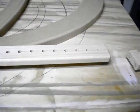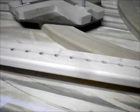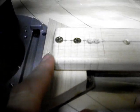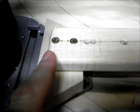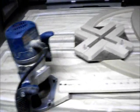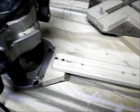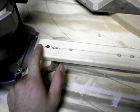Then what you have is this arm here — this is just a piece of three-quarter inch maple with holes drilled every inch. I have quarter-inch spacing over here, so I can move it forward or back a quarter inch at a time. That's actually quarter-inch per radius, so the diameter would be in half-inch increments, meaning I can get within a half inch.